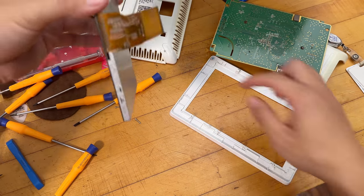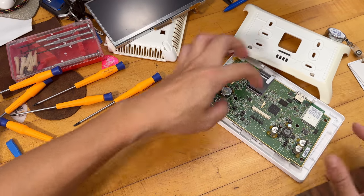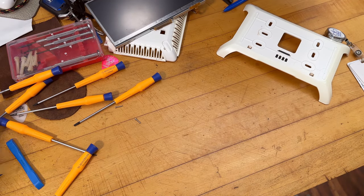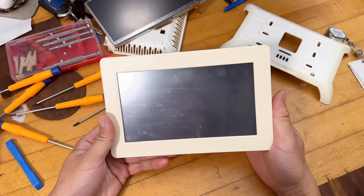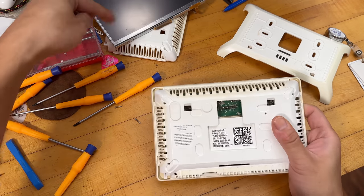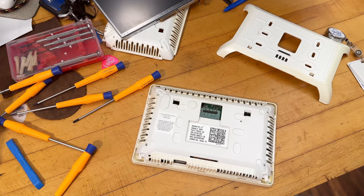Be really careful saving the temperature sensor so you don't damage it. The backup unit has done its job — the screen is out. Now grabbing the main thermostat: the Wi-Fi works perfectly, so the circuit board is fine. The only thing not working is the screen. Going to do a screen replacement from start to finish — screws set aside, remember you need a T5 torx screw.